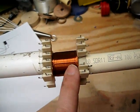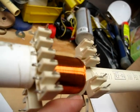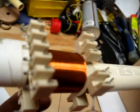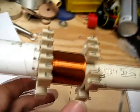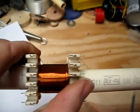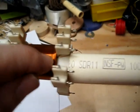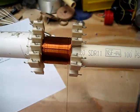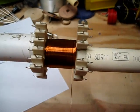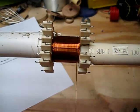I've wrapped on 21 layers. The main thing is to make sure you bring it out to where you just have enough room for one layer of tape and then your one last layer of wire — your larger gauge wire. So 21 layers on this one. You can see here the notch or the large groove we started in with our high voltage output — it's tucked down in there nice and tight. You can see we're not going to have any trouble with that arcing over. Now I need to get you a measurement — we need to leave an extended piece of this wire coming out.